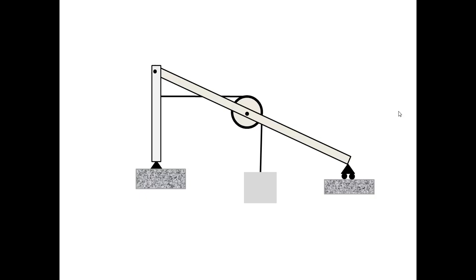What this means for the original structure is that I effectively remove the roller and replace it with a pin support at D. You may examine this modified structure and consider whether this solution is physically satisfactory.